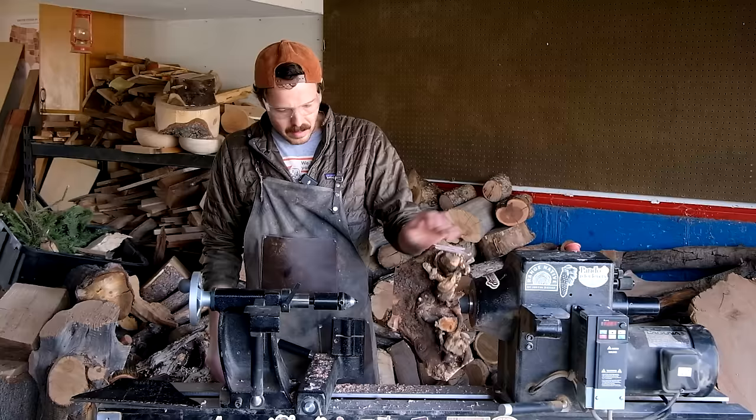I feel like I've carved about as much of the middle of this bowl out as I'm comfortable doing, so it's on to sanding — I've got to be a bit careful since there are so many wild root parts flying about when this thing's spinning on the lathe. One wrong move and my hand could be in for a real bad time. So it was a lot of hand sanding, but honestly not too bad. I think this is about as good as we're going to get it. It's time for the best part — let's hold our judgment until we see what this wood looks like with a bit of oil on it. Going with walrus oil cutting board oil finish on this one — keep it nice and simple, let the color speak for itself.